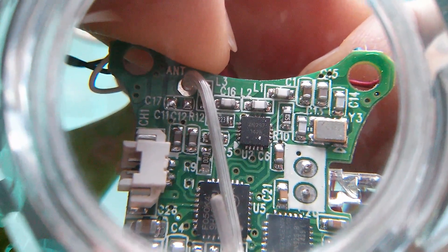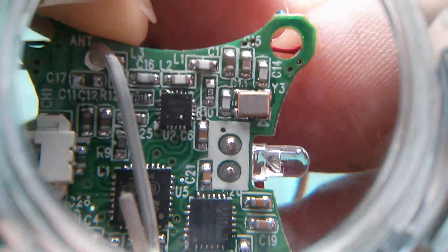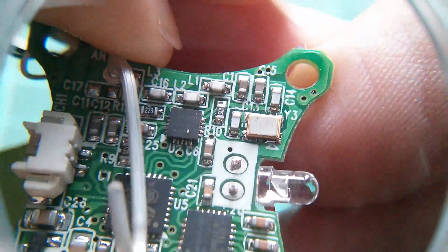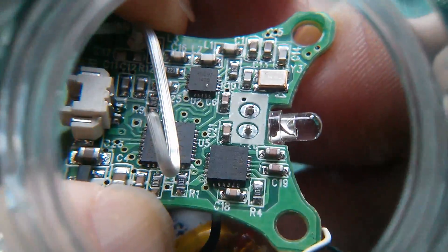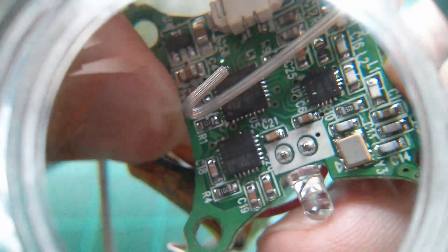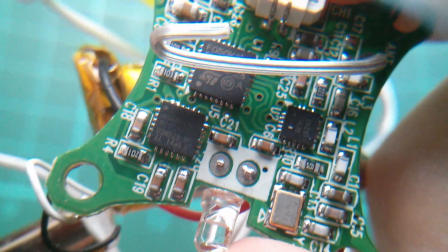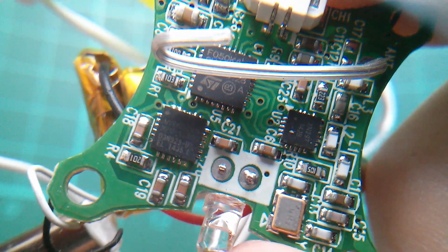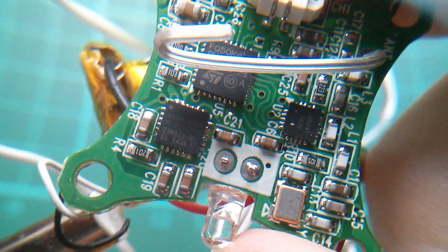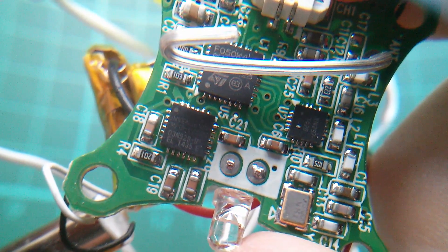The smallest chip looks like it's an XN297 — I think that's what it is. And the crystal there — 25 megahertz, I think. Now what's this medium-sized chip? Yes, that's an InvenSense MPU something or other — can't quite see the number on there. But they make the gyro and accelerometer chip, so that's almost certainly what that is: gyro and accelerometer. My guess then is that the little chip on the right is the radio receiver — I think that's probably what that is.